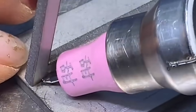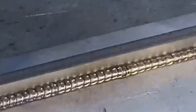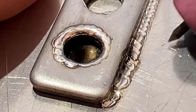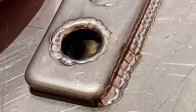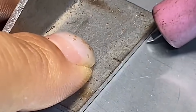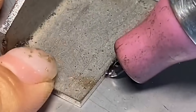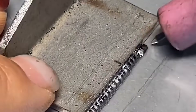Since the volume of the molten pool generated by each welding pulse is less than one cubic millimeter, the stress formed by it is relatively small. Although a welding repair requires multiple molten pools to be combined, the stress direction of the solder joints is dispersed, so the metal objects are exposed to less concentrated stress and experience less deformation after welding.